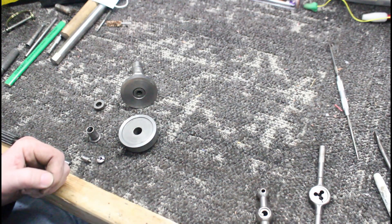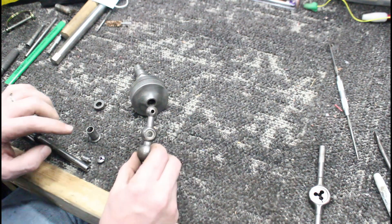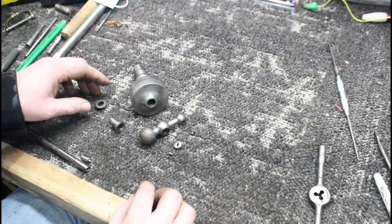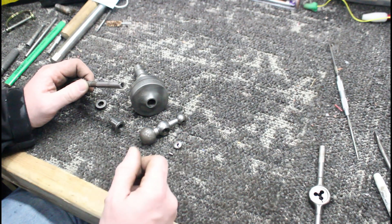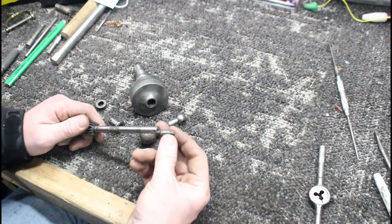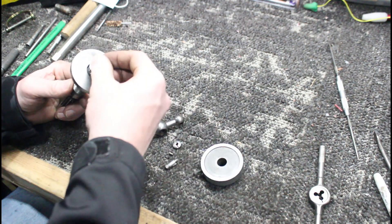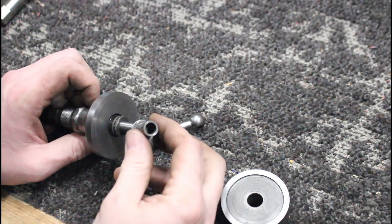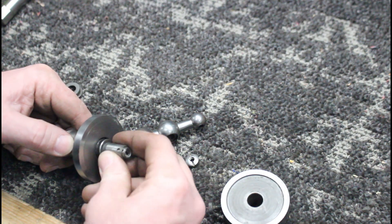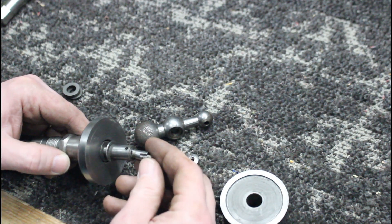On top of that, it's got a couple broken parts. This is the dial and handle, which is missing the little handle — a little screw and all the pieces that go along here. What happened was this thing got tipped or hit in shipping, and this piece right here broke off. When this all goes together, this is for a taper attachment on a South Bend Heavy 10. This collar slides on there, there's a taper pin that fits in there, and this is what holds the handle on — that broke off.